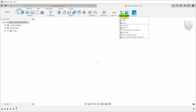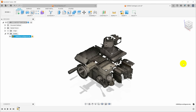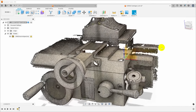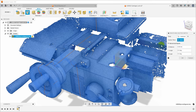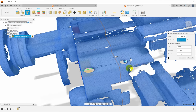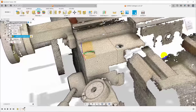The best way I've found to bring mesh data into Fusion 360 is with the Insert Mesh command. I select the OBJ file, set units to millimeters, and confirm the coordinate system lines up — orienting in the scan software appears to have worked. Scan data or mesh data in Fusion is not really a first-class citizen: you can't align anything to it or even select points in it. To work with it, we need to move to the Mesh workspace and choose Create Mesh Selection Sketch, selecting the front plane and dragging back a plane from that. It creates an orange line wherever that plane intersects the mesh — not real sketch geometry, but something we can use to create sketch geometry.